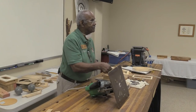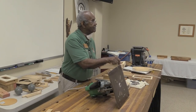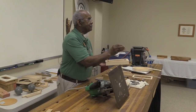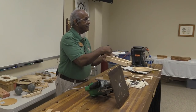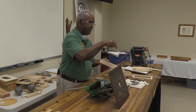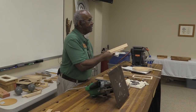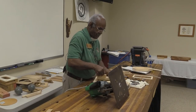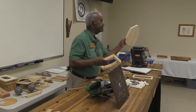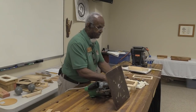Sometimes if I was doing a box with cherry, I might put a little maple strip between two glue-ups of cherry — then it looks more like a design than just two pieces of wood glued together. You can do the inside of the box and the strip doesn't have to come all the way through. I was just showing how you can do it with a different shape. You can go all the way down to where your bottom is at the thickness you want, and if you need to do a little sanding in the corners, make something to get down there and sand the bottom flat. So with that, I hope you enjoyed it — thank you, and we'll see you in two weeks.